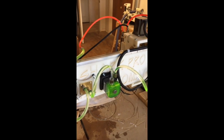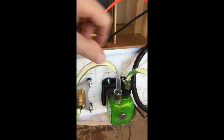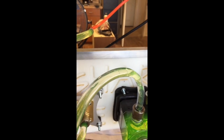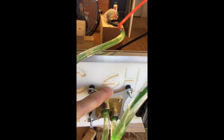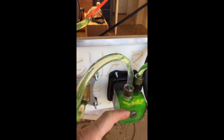The system is full now. There's a little air pocket right here — there's not much flow going by and it's only a trickle, but you can see the water flowing and that's all it needs to run as it flows through the cooler. I kept getting a big air pocket here, so I would take the hose off and use a syringe to add more antifreeze. Make sure you lay down some plastic and then towels so that as you're filling it any drips don't get all over your board.